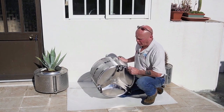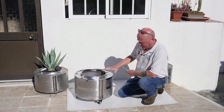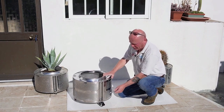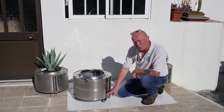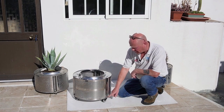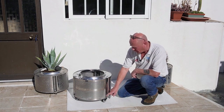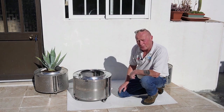Once you've got your wheels onto the drum — these have locking tabs because they're off a toolbox, so you can lock them in place to stop them moving around — it's a good idea to spray them with a lacquer. The shafts on these wheels are not stainless steel, so spraying with lacquer will protect them from the elements.